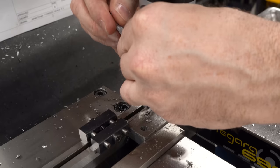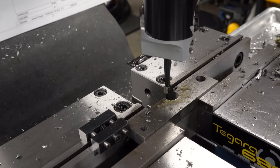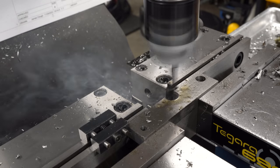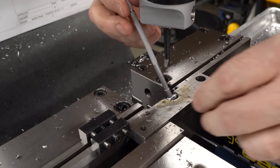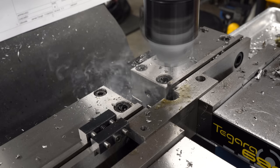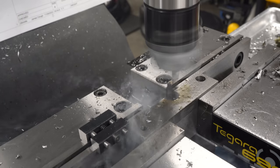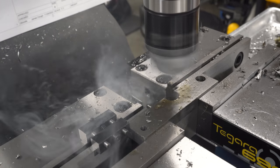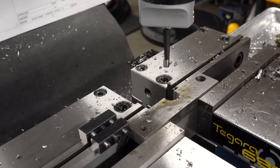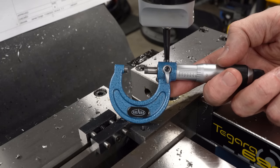Now that we're getting close to the final diameter, it's time to start taking some precision measurements. I'll switch to the telescoping bore gauges since there's not enough hole for the three-point internal mics. I dial in half of the remaining material, take one cut, measure, then take the final cut just like on the lathe. But that last cut sounds heavy - maybe just because the markings on the boring head are so small and close together. Final measurement: should be at 0.625, and we're at 0.6265 - a thou and a half over.